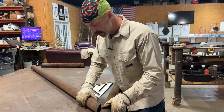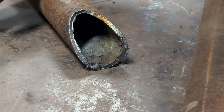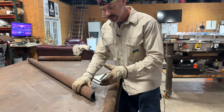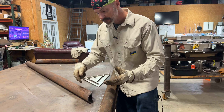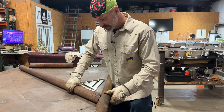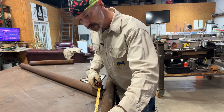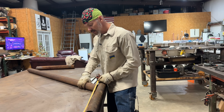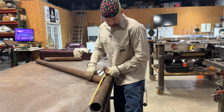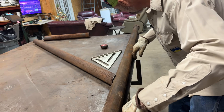Now we've got our regular 45 cope — we haven't even hit it with a hammer yet, probably should. But for the sake of the video and building these fast, that's the one we cut with the plasma cutter and haven't touched it. We're gonna stick it up 22 inches down from the top — doesn't matter as long as you're making them the same; 22 or 23, it's a corner post, it doesn't matter too much. So we're at 22 inches here. This one is parallel with the table. Take your square, run it up here — and there's your 45, right there. Anybody could weld that.